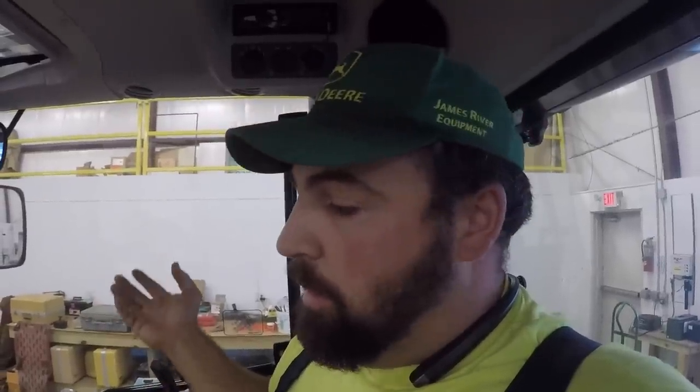And I was like, something is not right, because I could turn the air conditioner off for about 5 minutes, cut it back on, and then it would be freezing cold in here again, even though it was really hot outside. It would stay cold in here for an hour or so, and then it would start getting warmer, and warmer, and warmer, and then you're like, what is going on? What was happening was it was freezing up. The evaporator core was freezing up because the AC compressor was not shutting off. It wasn't cycling. So I talked to the dealer, and he hadn't heard of the problem on this particular tractor, not yet. He has now, because I think he asked me about working on one the other day.